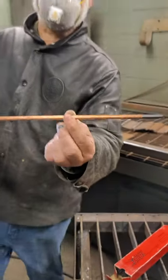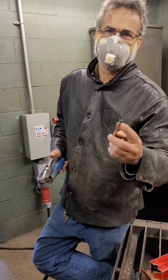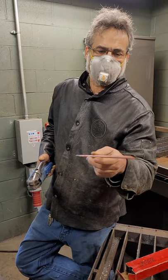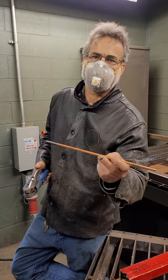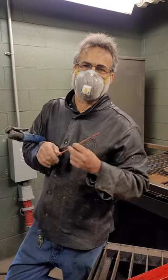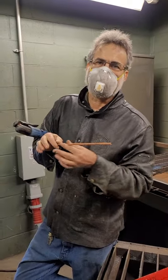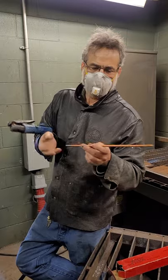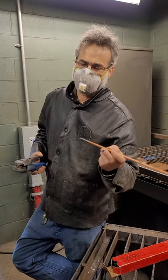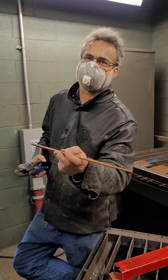This electrode is made out of carbon — it's just like a pencil lead. As a matter of fact, we can write on cardboard with it. On the outside they put copper, and one of the main reasons is to make it harder to break, to make it strong. I have seen rods without any copper on them, but they break real easy unless they're thick. A lot of times people who have never done carbon arcing before look at this and think it looks like a stick welding electrode and want to put the wrong end in.